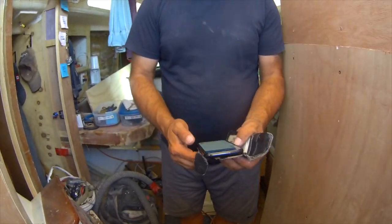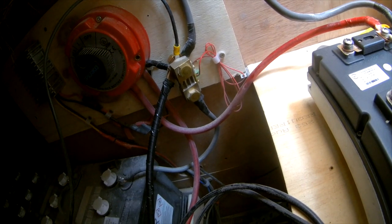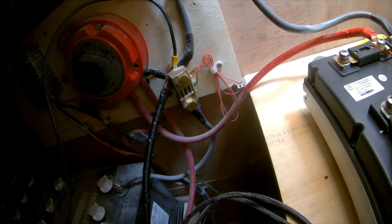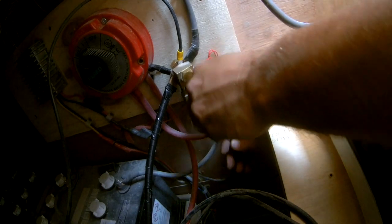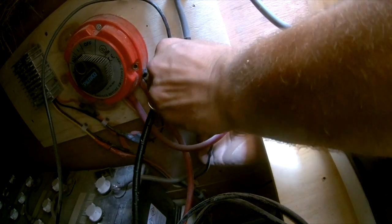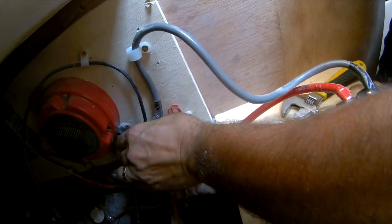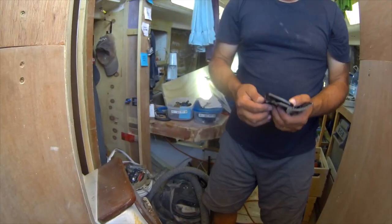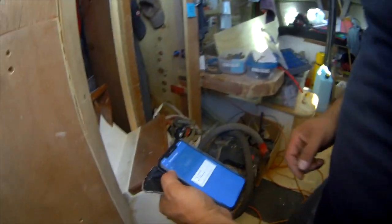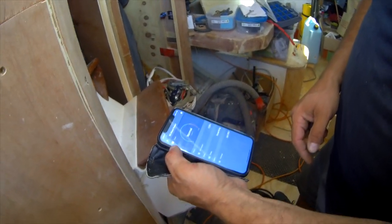I'll turn the power back on. Firmware updated — continue. I accidentally pulled the battery monitor off. That's got to go into that little bus. This is a bit awkward to get your fingers in the right position. Okay, that's good. So that will power up the battery monitor. It says load normal, AC output 120 — it's inverting.